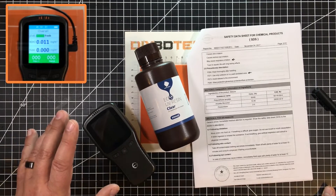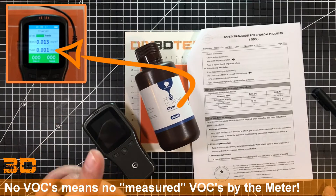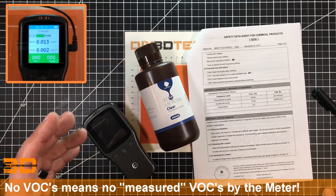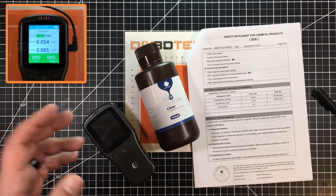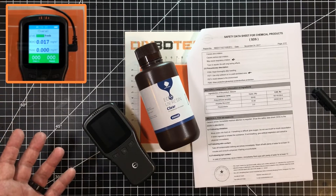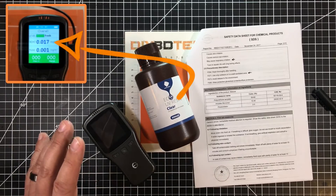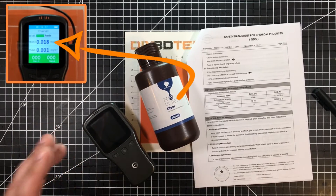In the long story short, I was really surprised there were no VOCs — volatile organic compounds. We've seen quite a few of those when printing with FDM, especially with styrene-based plastics like ABS or ASA. However, with this, we saw no volatiles. But what we did see is a steady rise of formaldehyde inside the chamber.